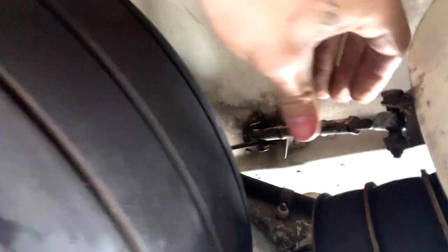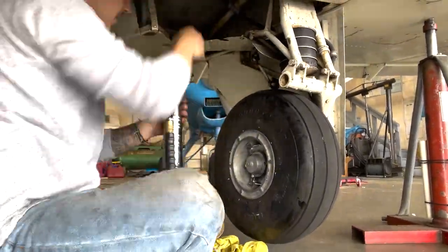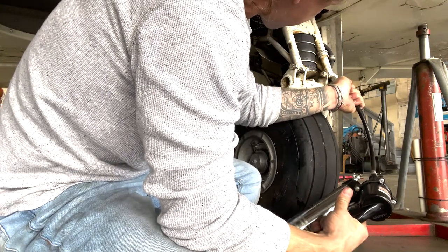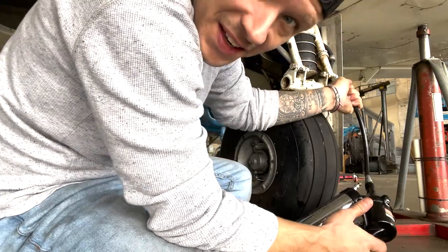Got the wheel put back on — everything's done in here. Gear door is back on, brakes are back on and safety wired. Lubed up the linkages — they were kind of tight so they're nice and loose now. And now we've got to grease everything.